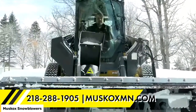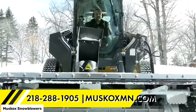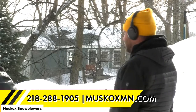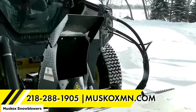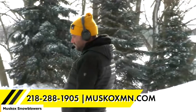But also with that, by lowering that chute, we have found that we plug significantly less. We just don't have as much surface area that snow needs to climb through on those wet, heavy snow conditions. Today it's super dry. That's nothing that we are concerned about today. But when we do have those days that it's great to make a snowman, it's kind of hard to move snow. Chutes plug, and we've helped increase that quite significantly.